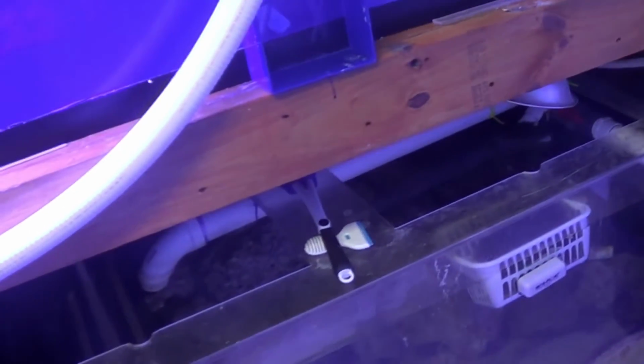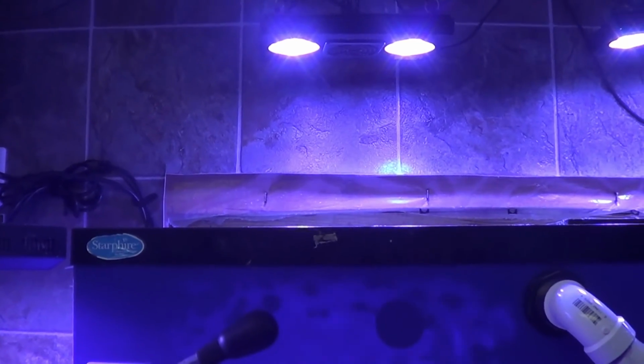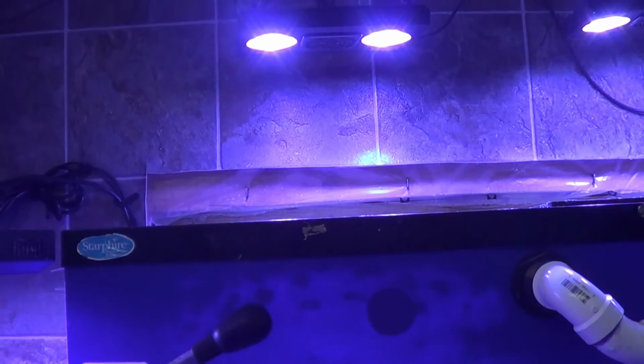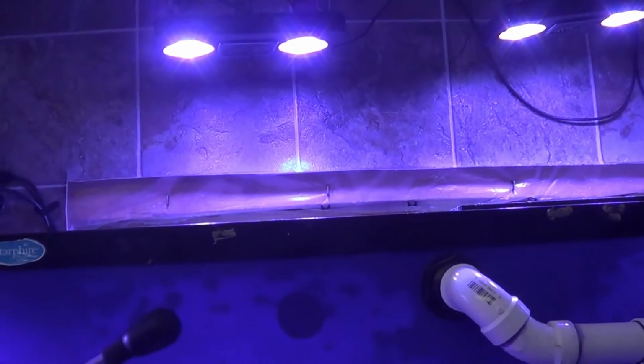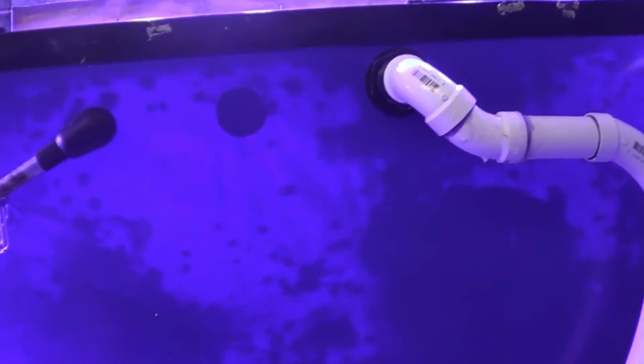And on this closet here, when we get to the side of the room, in there is my sump, where the water theoretically will go down and pump out, obviously. It's the sump for the house, so it's probably the safest place for that water to go if I do have a catastrophe. And then on the other side of that wall is mold-resistant drywall, so the stuff that you put in bathrooms, again. That wall is designed so that if there is an issue, it should bounce right back.